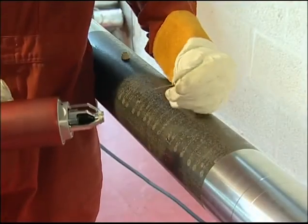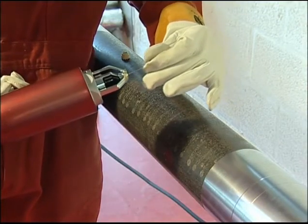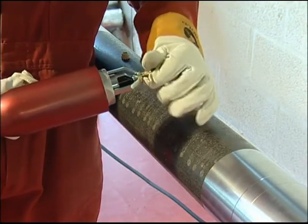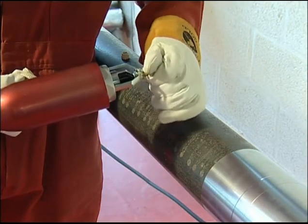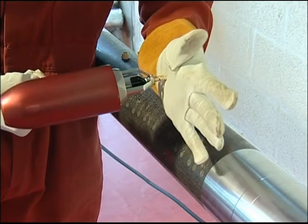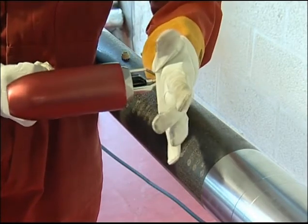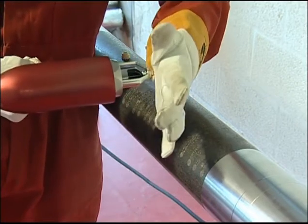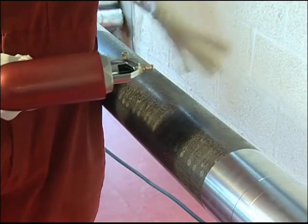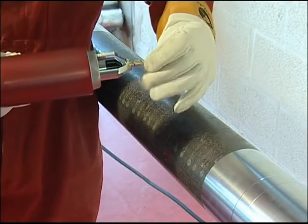Carefully insert a brazing pin, which should have a straight fuse wire with the kinked end still intact, as this will gain optimum contact with the contact nipple inside the gun. Make sure the fuse wire does not get jammed and push it hard and fully into the pin holder. This must be a very tight fit. If the pin is not a tight fit, then it is possible that the jaws of the pin holder have become flared and will require adjustment.